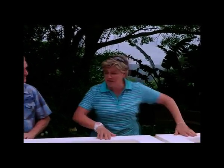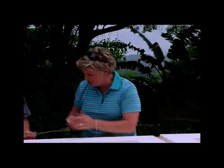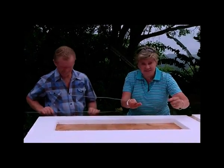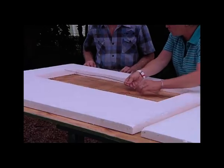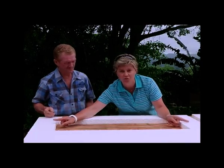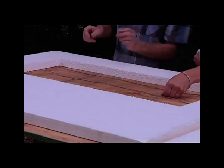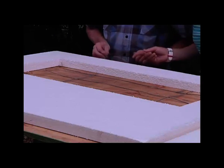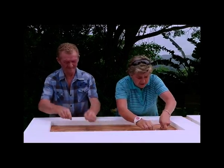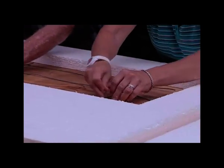So we've got our molds ready now. This is going to be the seat and these are the two legs. All we've got to do now is just prep a bit of reinforcing because this is a long length, just to make sure it's going to be ultra sturdy. We've got some 8 gauge wire here — we're going to put that in 1, 2, 3, making sure you've got enough gap across either side so the wires aren't sticking out. Then we've got some tacking wire, much thinner, able to work with. Pop it on and you're literally just going to tie it together because that helps keep it in place.